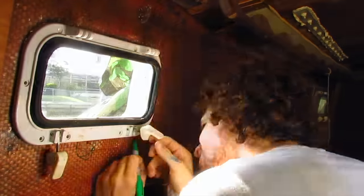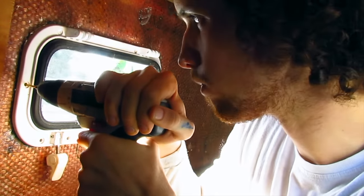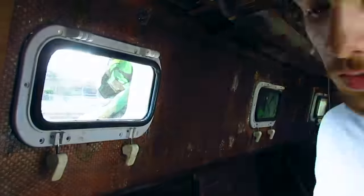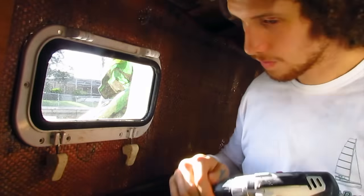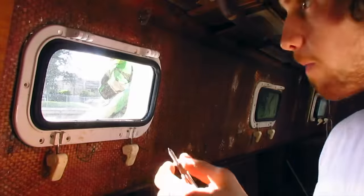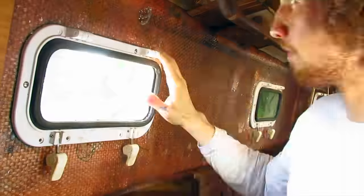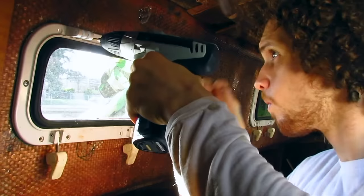After sanding everything, we positioned the frames on the walls and, with my uncle's help, drilled the holes where the screws were going to go. Okay, now I'm gonna put in some screws. Pro tip. Once you trace a line around the frame, put in a couple screws so you don't mess it up when drilling the following ones. I kind of failed to do that in the first one and the screws got a bit misguided.